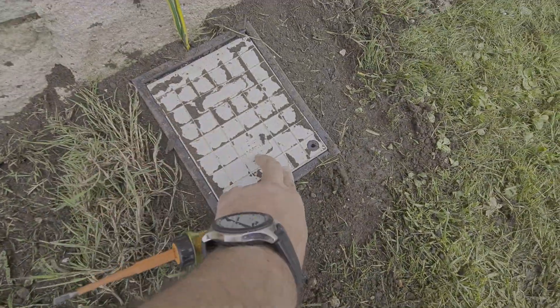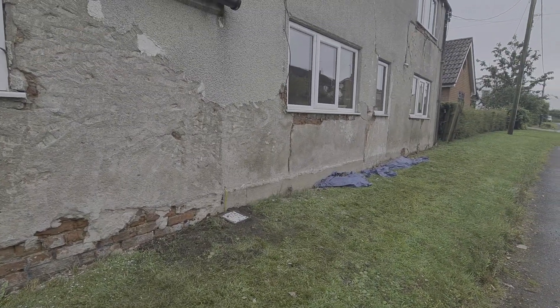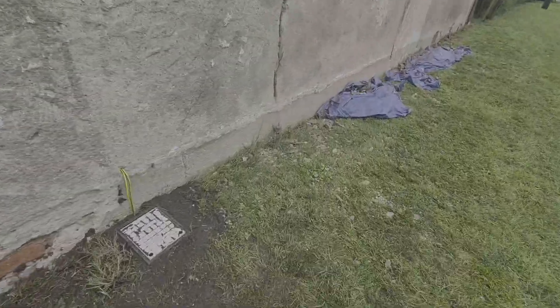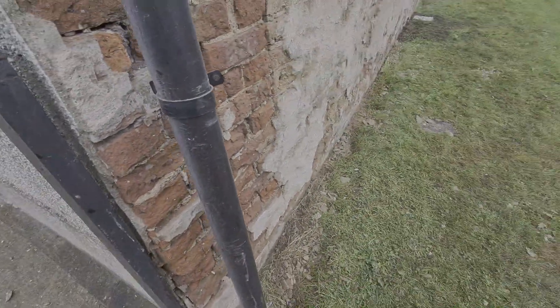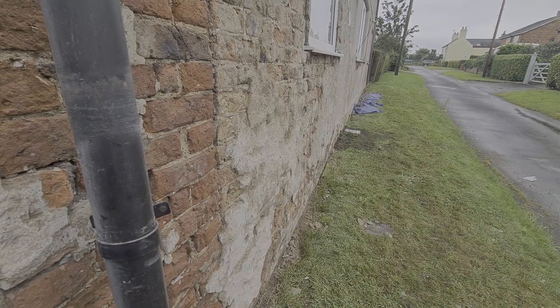The pit's looking good — a spider has already moved in. The cable going through the wall is temporary as the render is all coming off so there's no point doing anything too fancy yet. The old rod we had originally was giving a value of nearly 1,000 ohms, so it wasn't doing a great deal anymore — possibly a termination issue rather than the rod itself. We've gone for a nice copper rod in a proper pit. We were careful of the water pipe in the ground so we positioned the pit where we were confident there was no pipework.